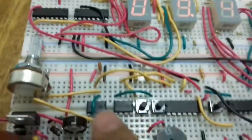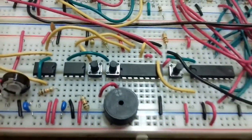You can use this as a track timer circuit. Let's say this is a racing track with lights counting down three, two, one — after one, you can set this circuit to trigger the start button. That trigger is connected to the start button here, and then all the cars or runners go, and at the end of the track you can put a laser and a photo transistor or something else to trigger the stop.